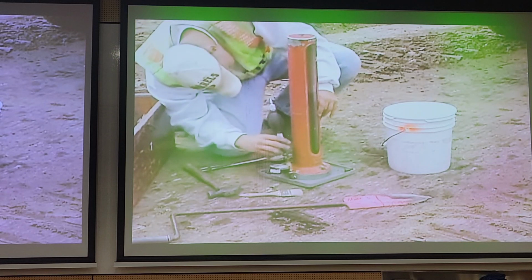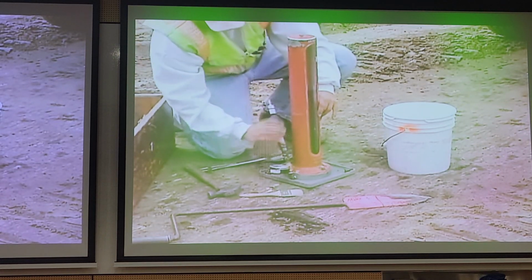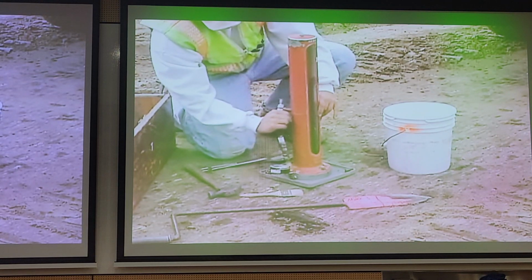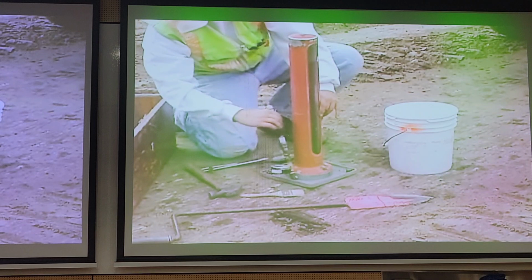Lightly tap the gauge to help stabilize the reading. Once the final reading is noted, reverse the bulb-type pump in the quick coupler and pump the water back up into the graduated glass cylinder.